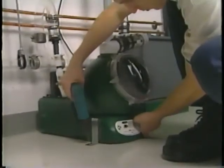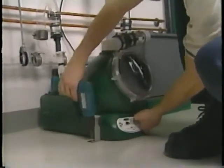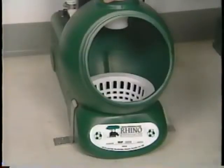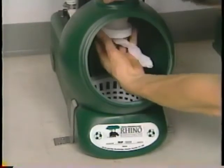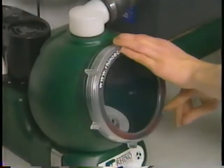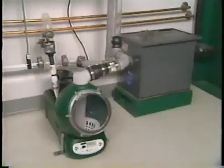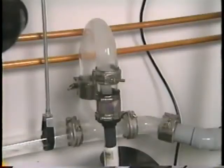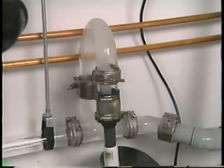Once you've got the exit line firmly connected, secure the pump unit to its base with the ground brackets in the same way you did with the gravity unit. Next, insert the strainer and a filtration membrane, then plug in the pump unit and test it. As soon as the pump unit is plugged in, the pump will automatically kick on for 20 seconds. Run water through the unit, making sure all connections are firmly secured and that there are no leaks. As soon as all wastewater has been pumped from the Rhino unit, the pump will automatically kick off.